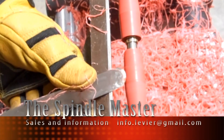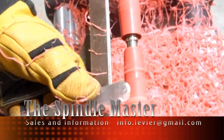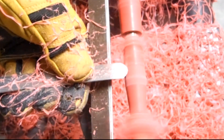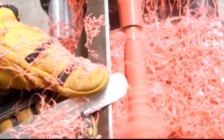The spindle master is an alternative tool instead of using the skew. It is a tool that is easy to control and the definition of our designs is very well achieved. As we can see in these cuts, the end result is not as clean as the skew, but we can make it better if we change the position of our cuts. It is also important to see the shavings that are coming out during these cuts — once again, a highly sharpened tool with a world class quality pen blank.